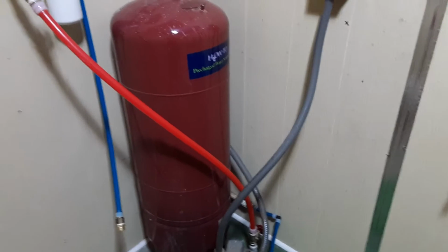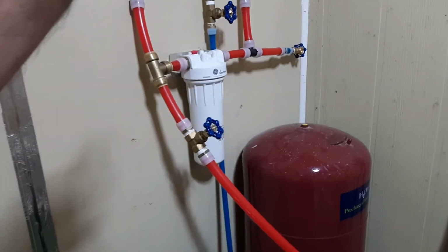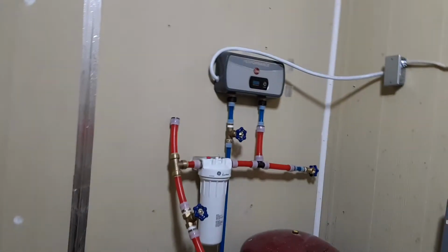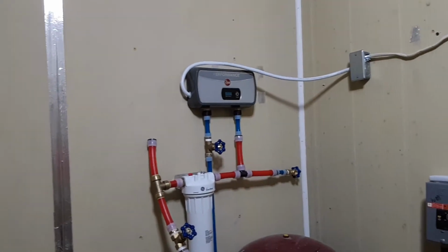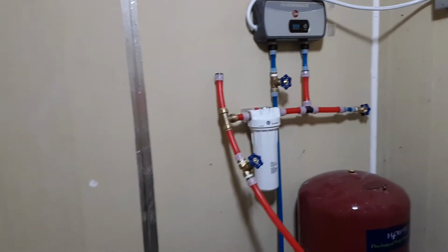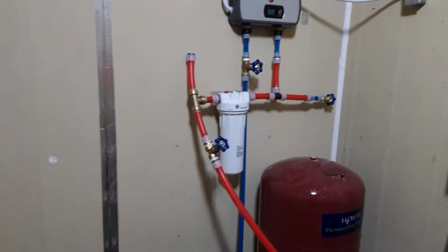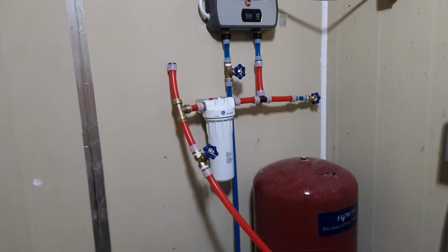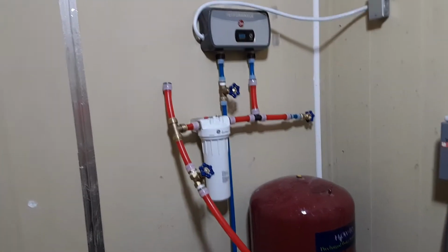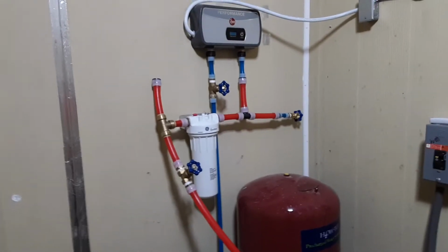It's my primary valve. And then if I throttle it, because it's a small electrical water heater, on demand style, it's not going to put out a whole lot of hot water. It'll heat up if you run it real slow, but basically this valve here is going to be the valve designated to take that pressure cut over time. Long duration, it may eventually cut out, not running it wide open, but I figured I have it, and it also works handy for when I change my filter out, having it right there instead of having to lean down there and close that valve. Not really much of a big deal, but